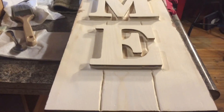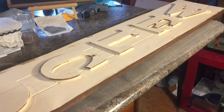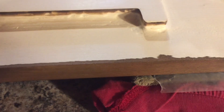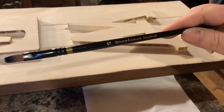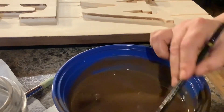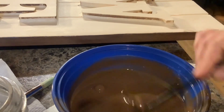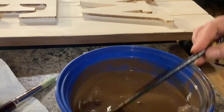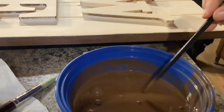That's it dried — I let it dry for 24 hours, and I'm finally ready to paint the front of the sign. So just showing you here some of my stain and some of my clears — ran over the edges and that. So I will actually take 220 grit sandpaper and sand that down so that it's not so pronounced when I go to put the stain on. I'm just using a flat edge brush here — nice and soft, it's an oriental brush. I just had put the lid on this container and put it in the fridge so I would be able to use it on the front of the sign. So you'll see it's nice and thin, nice viscosity.